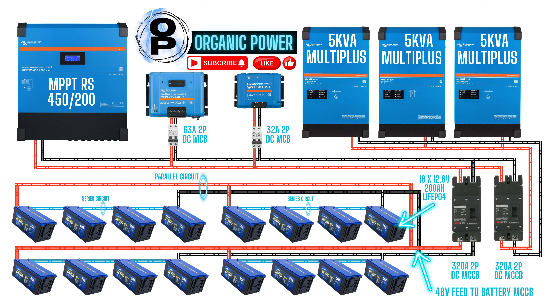Another thing not shown on this wiring diagram is how many cables run between each of the components. From the battery bank to the line side of that first MCCB, there is a parallel connection of two 70mm squared cables. At the top of that MCCB there are two parallel cables up to the MPPT, and from the bottom of the inverter MCCB there are three 70mm cables — three for the positive and three for the negative.